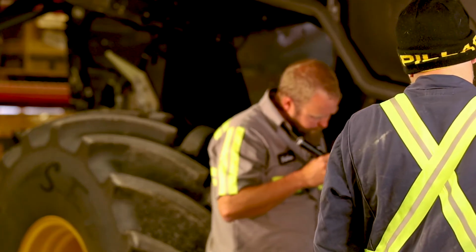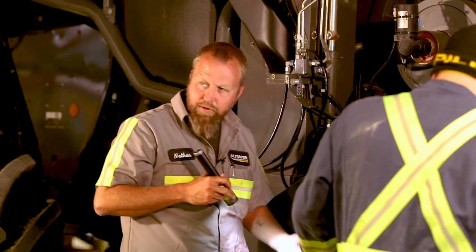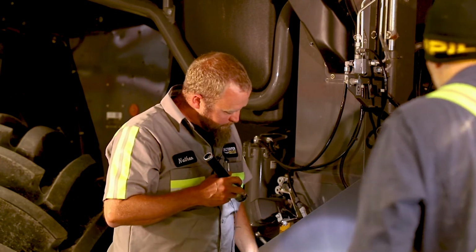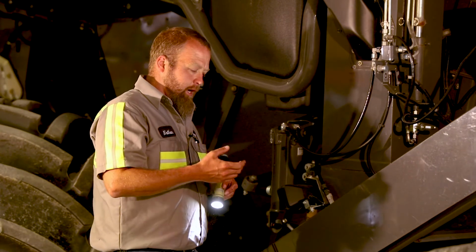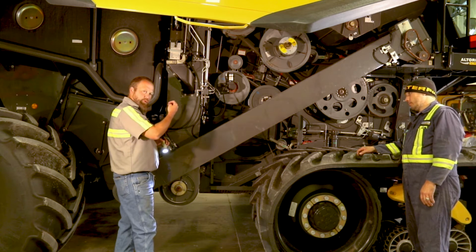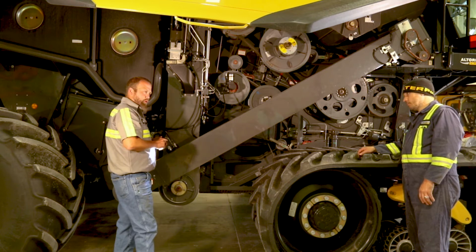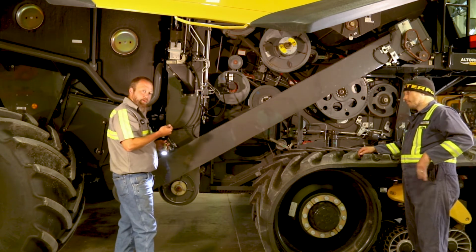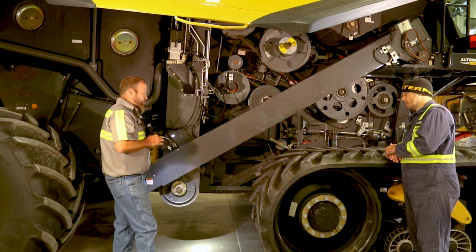Clean grain, it's the same thing. Anybody who's been around combines, check your sprocket wear, your chain wear on your clean grain chain. Check your boot, depending on the amount of bushels you've had through it. Basically right where your cover goes on, the lip that goes up behind that, right behind that's the first spot it's going to get thin. So I usually take a small hook bar or something and just kind of tap it. If you can put a dimple in that metal at all, you should replace it, because it's not going to last a whole lot longer.